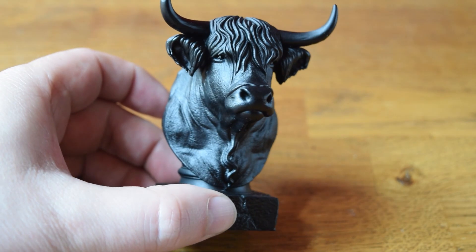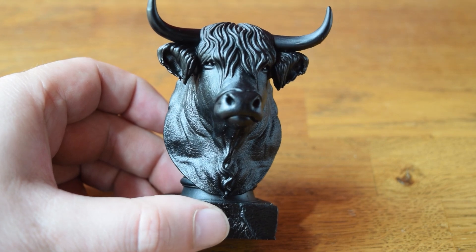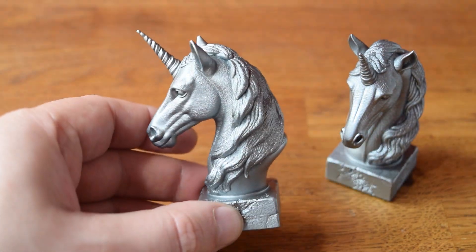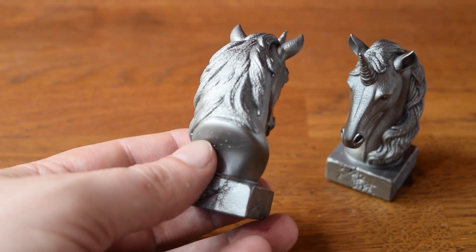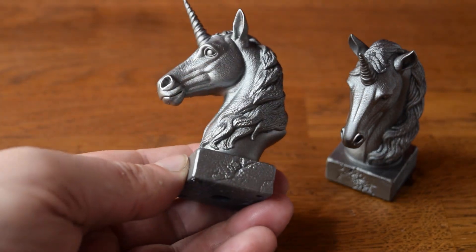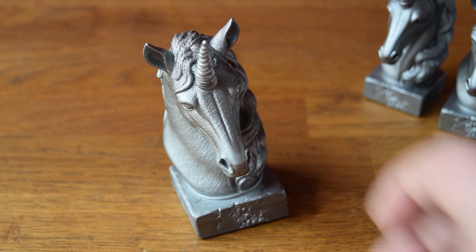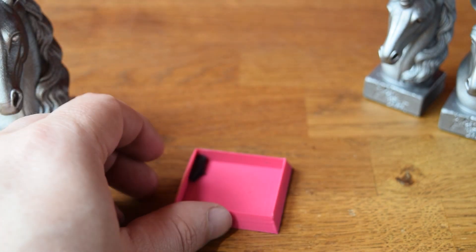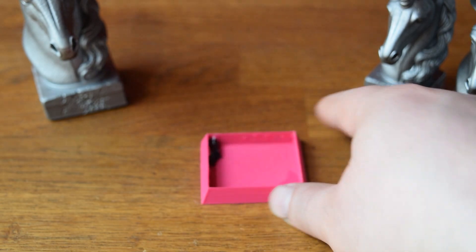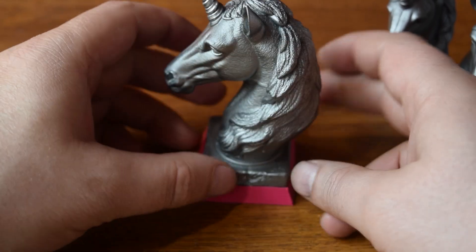The mess is a lot less than it was, but if you're in a one-bedroom flat or apartment I wouldn't recommend resin 3D printing. I'd only suggest it if you have a spare room or an outside shed to work in — and remember you don't want to expose the printer to direct sunlight, so it needs to be an internal space. One advantage I have is a small shared garden where I can put waste paper towels to solidify in UV light. I now produce less than a bag's worth of trash per print session, which is the biggest thing I've learned.